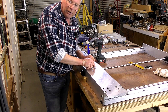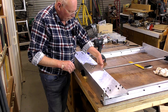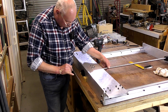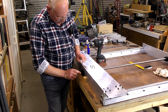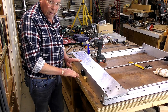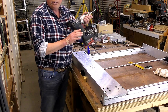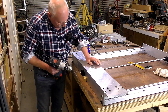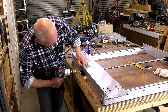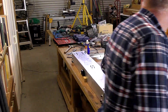I've mounted the bearing on the cross member, all tightened up. The screw shaft is into the bearing housing and I've got a little block of wood holding it from turning. I'm going to pop a drill through here — first at tap-in size — and I'm putting a clamp on it to stop it sliding around.